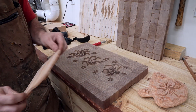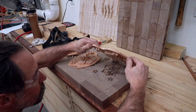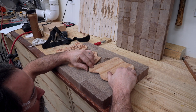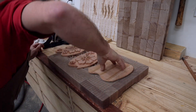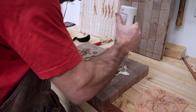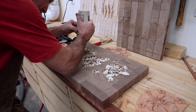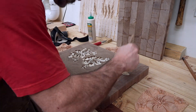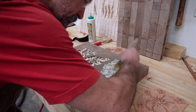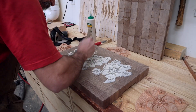Getting an inlay to fit really well takes a lot of time to dial in the actual process. You have to do a lot of test cuts, cut the pieces in half, and just analyze what's going on to make the fit be really tight — and to ensure it's not too shallow, where it would be kind of hollow under the inlay. I'm still refining my process of how I want to get glue into the pockets, and I tend to put a little bit too much glue on, which I think causes some problems later on.